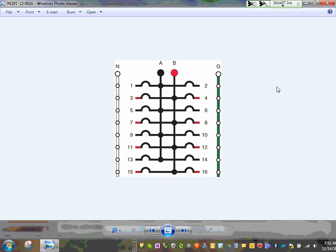Can you guys see that? Say if this is a 100 amp panel, this is a single phase 100 amp panel. Can you guys see phase A, phase B, or hot one? Here's my neutral, here's my hot, here's my ground, typically. And can you guys see they number them? One and two are connected to the same hot, and three and four are connected to another hot. Do you guys see that? This is single phase.